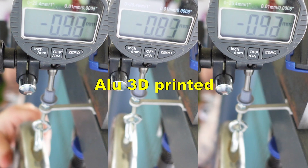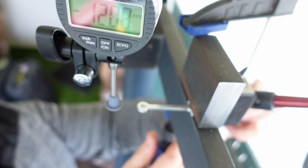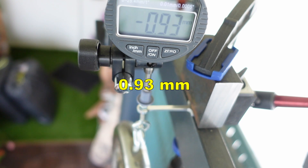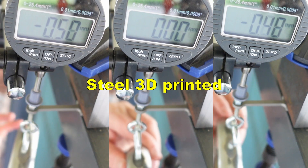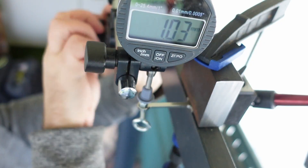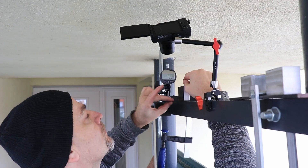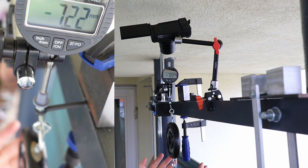These are 3D printed aluminum test objects — very similar values I got here. Then moving to CNC machined aluminum — again the result is very similar to the 3D printed versions. Then moving to 3D printed steel — again a very similar result, approximately 0.5 mm deformation, and of course it was stronger than the aluminum parts. Then this is CNC machined steel — and this was quite obviously stronger than the 3D printed versions. And let's not forget our FDM 3D printed plastic: using only 1.25 kg instead of 2.5 kg, the deformation was more than 7 mm, and I was waiting approximately half a minute until it stabilized.